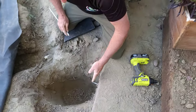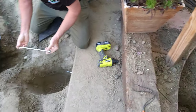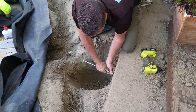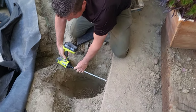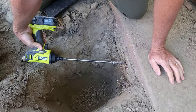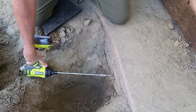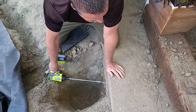So check this out — we've already drilled through to about here and this is about ready to come through the other side. Adding extensions on is really as simple as pulling that back, making sure you're attached, and then putting the extension back onto the drill, so you really don't need that big of a hole. To pull the dirt back and pull the auger back through the hole, I just set the drill in reverse.